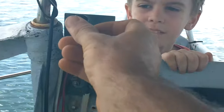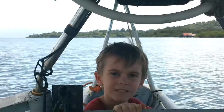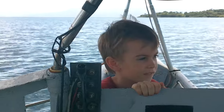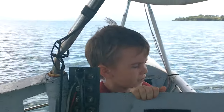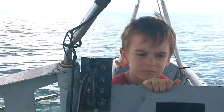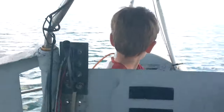Let me just check that I'm still getting reasonable speed — I hope I'm still getting good speed on this. All right, this is low speed. Does it seem much different than before? It seems about the same. The boat is making less noise too. I think the propeller that I took off was too high pitch — it was cavitating.